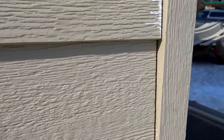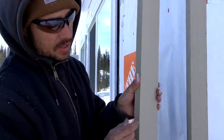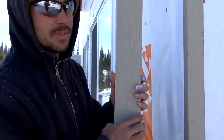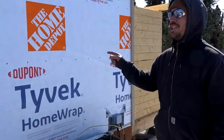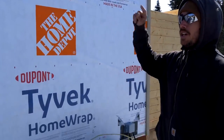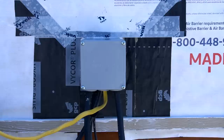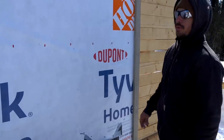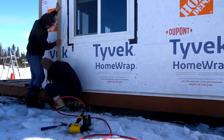This is our side trim, made by LP, the same company that makes the siding. The side trim on this wall is a little shorter than the front one because it overlaps, so the distance will be the same on both sides. It has a similar textured wood look as the siding. The windows we used pine, which was three quarters of an inch thick; this LP trim is actually one inch thick. We could have done all the windows with this trim but it's very expensive, so we're just doing the edges with it. The plan is to get this whole wall done today.